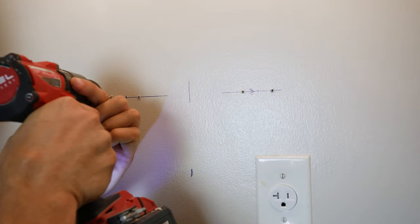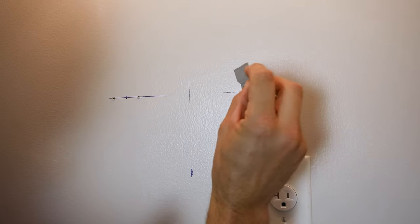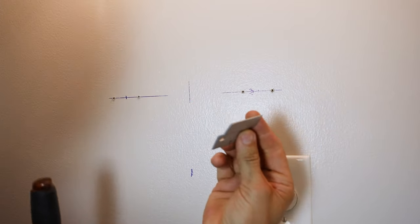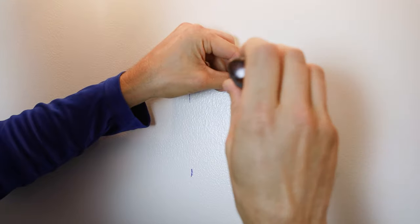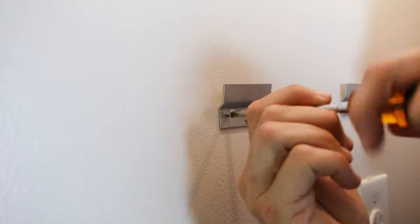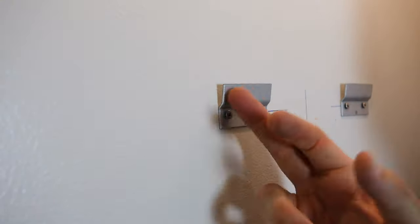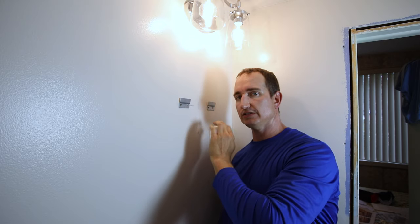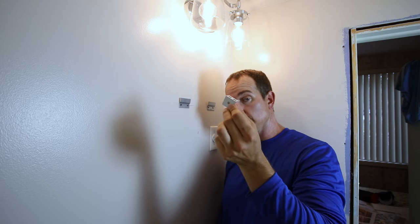This is a simple mounting bracket that mounts flat to the wall, leaving a little angled lip. There are slots on the backs of the mirror so the whole thing just slides in and sits on this lip. It's important to install these the right way with the little hinge sticking out. I hand-tighten the screws — since we're going into the stud, this will be a solid connection. You can see the lip on this end where the mirror is going to hang. Now I'm going to do a dry hang to see how it fits. But first, I'll install the bottom safety bracket on the mirror temporarily so I can mark my hole.